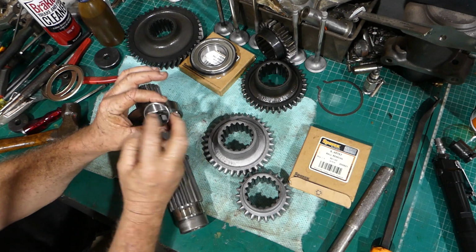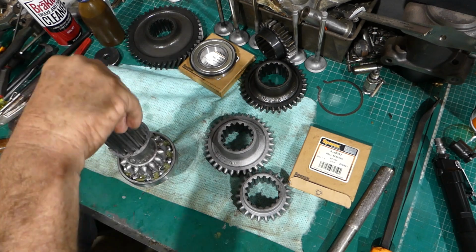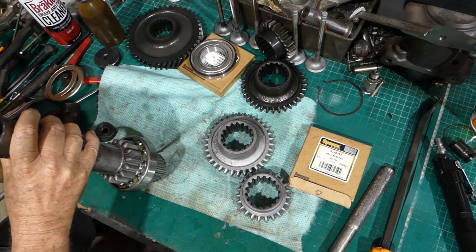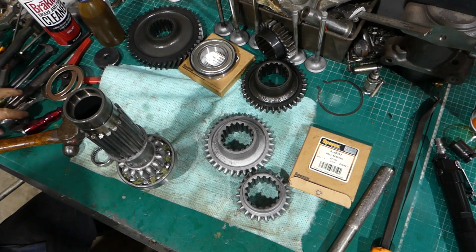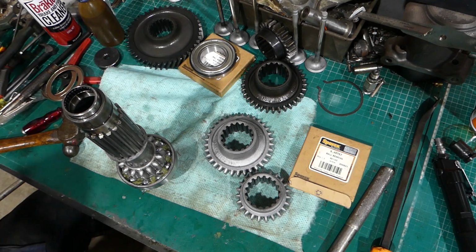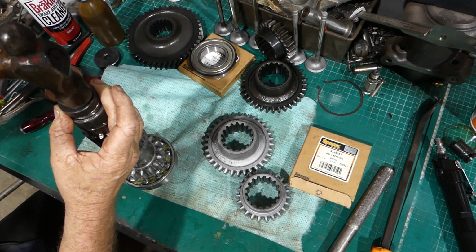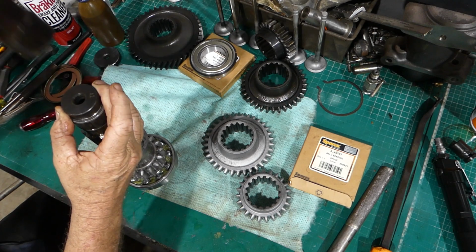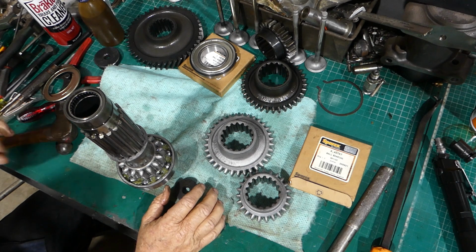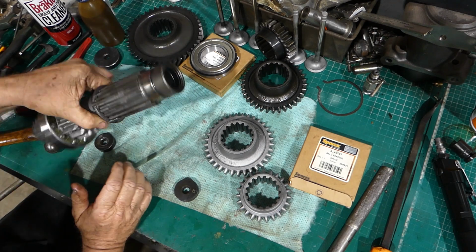And that's the flat surface there, there's a bit of writing on there. So we'll slide this one in. Well, we won't slide it at all, we're going to bash it in, if we're honest. Make sure there's no rubbish in there. Okay, so I've got a 42mm disc now. So pick the side that the writing's on and keep it upwards. And we'll just, you can feel that's gone home. There's a tiny little shoulder in there you can knock it down against. So that's fine, that's good for that.